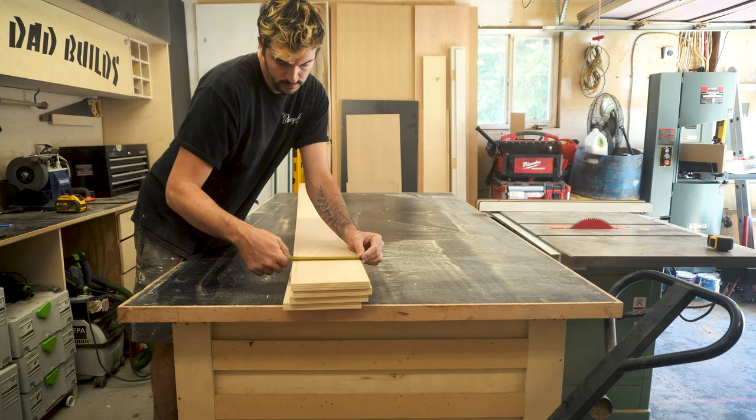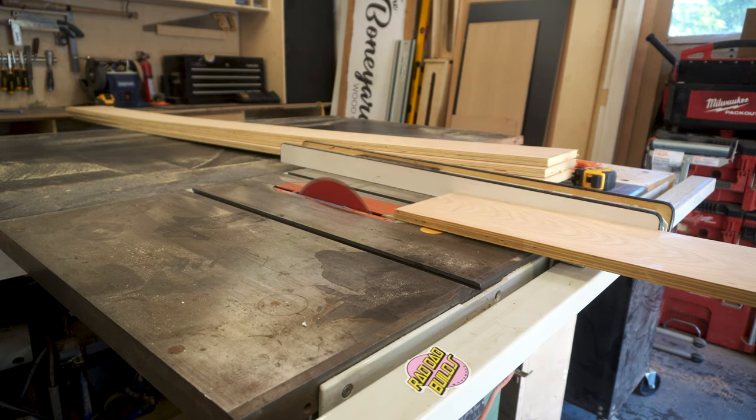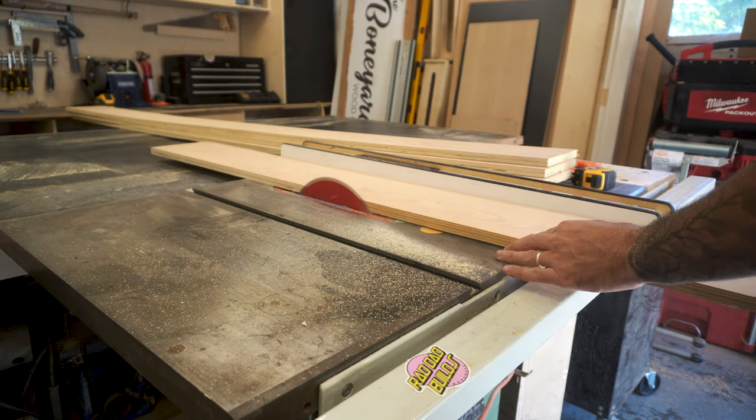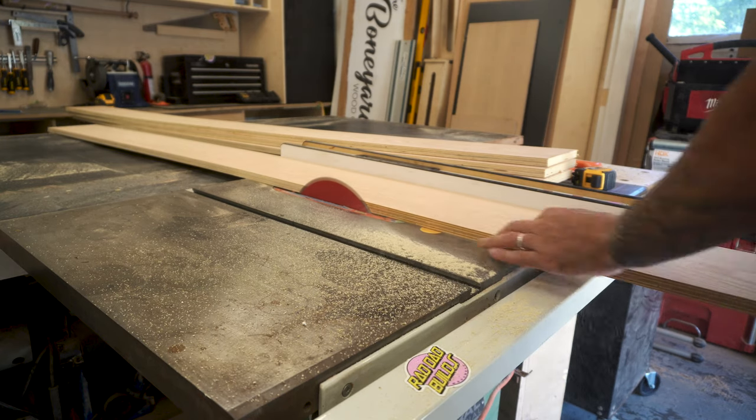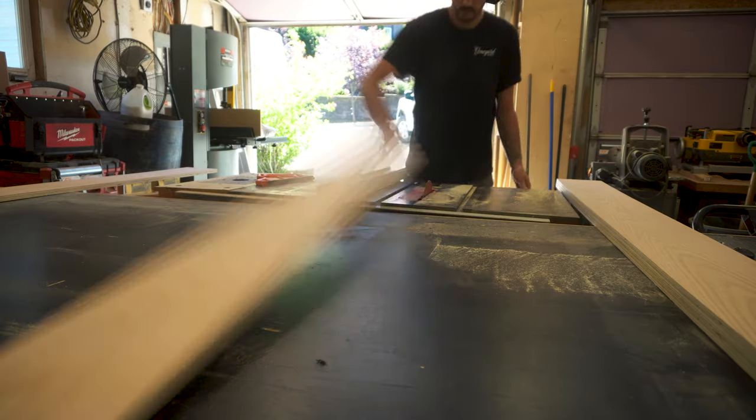I built this upper vanity cabinet in two sections, the glass mirrored section and the open lower section. I made a start by ripping down the pieces of plywood to 8 inches wide, which is the depth of the cabinet. I'll soon have all the measurements and plans available on my website, which I'll link in the description down below.